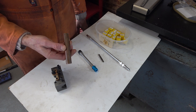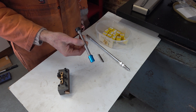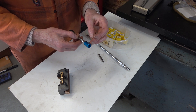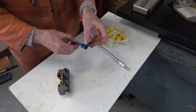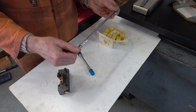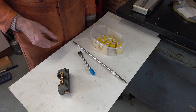This is Phosphor Bronze PB102 which I can use as a holder and as a bearing for the drill spindle. This is an ER11 long spindle collet chuck holder, and this is a part from a 3D printer — it's 10 millimeters at one end and 6 millimeters at the other. I think I ordered it one day and it arrived the next, about £3.50, so that was perfect. That will form part of the drive, because here's a hexagon drill drive — I'll make that fit in there, then I've got this flexible drive which will go on there, and the drill goes on the end. I've also got these ER11 collets; each one has a range of half a millimeter, so that's the basic project.